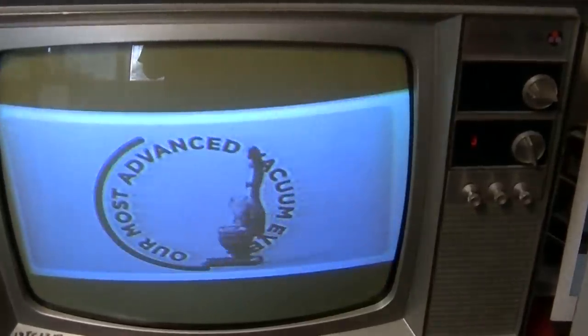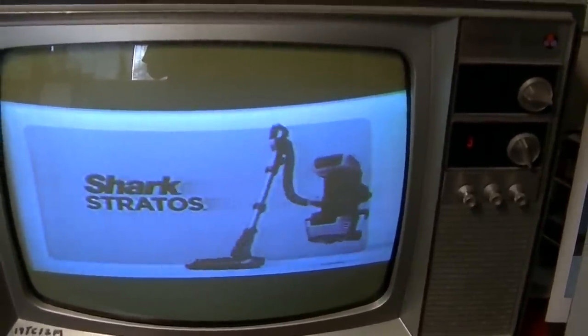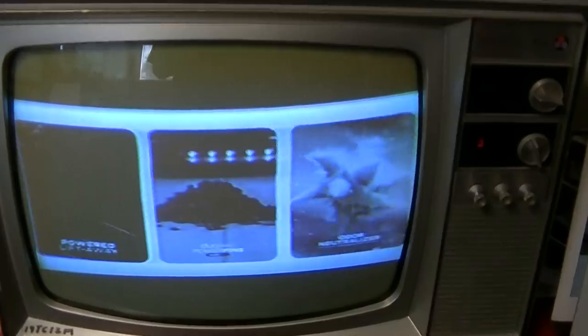And it's a Sylvania. I tried changing the tubes, the color demod tubes, and all the tubes in the color circuit with no improvement. So right now it doesn't even have color sync. You can see it kind of flickering there. So yeah, we'll pull the chassis out. We probably have a bad resistor, a bad diode, maybe an open coil.